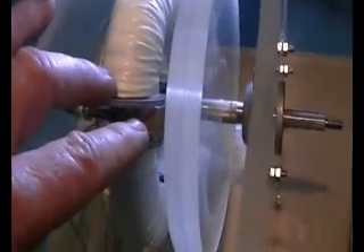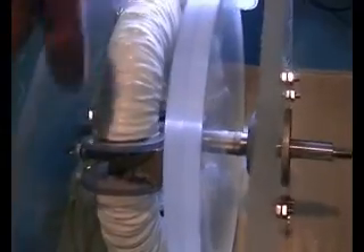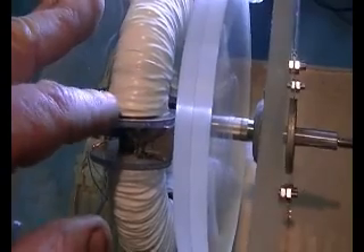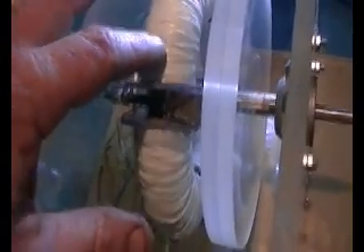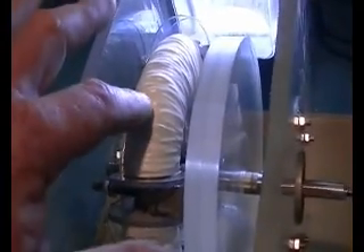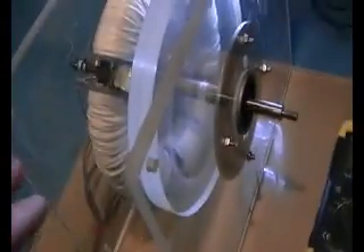What's happening in the generator coils is it's generating power from the magnets which are oriented north, south, north, south — so of course we get an AC voltage going through there. It's also using the transformer effect when the run coils fire; it sends that pulse of power through the generator coils as well. And then as per our standard SSG setup we're also charging our charge battery.